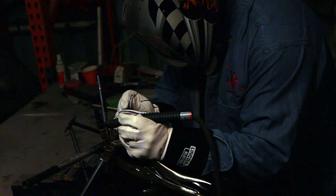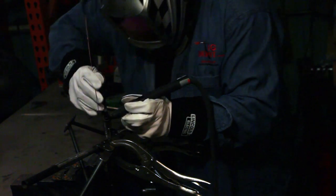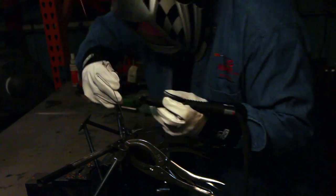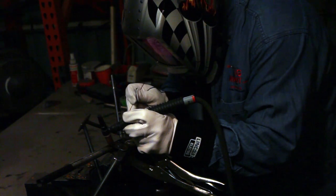Okay, made the tack weld. You can make as many tack welds as you like, as long as you absorb them when you're finished. I'm making another tack weld — I just don't want that plate to lift up. This is kind of a cross between a fillet and a lap weld. I've got my tack welds in there and I'm going to start at one end.